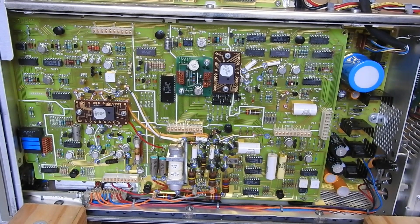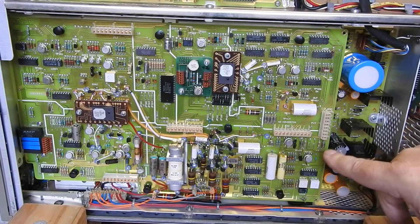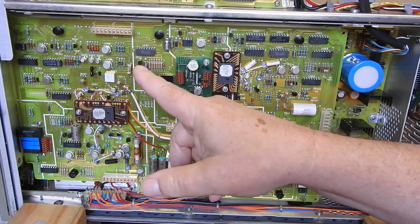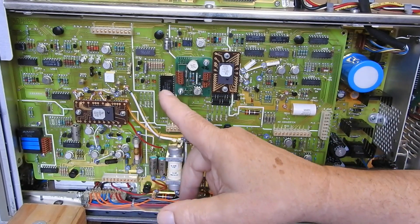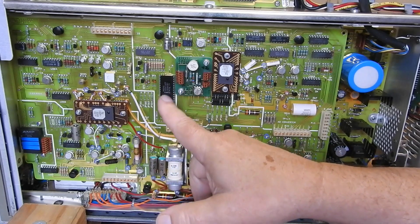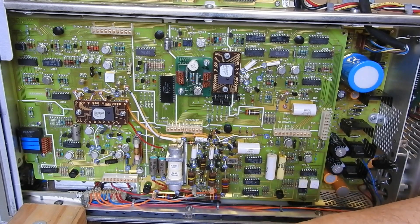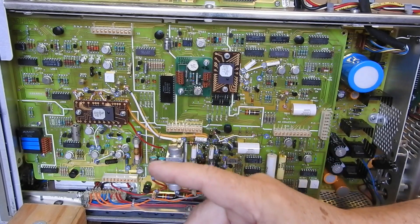Everything is so beautifully done — gold plating everywhere, lots of sections with air connections to Teflon inserts in the PCB for very high isolation resistance so the circuit board's resistance doesn't cause a problem. On the A20 board there are two more bits of unobtainium and the voltage reference using an LM399. There's also air wiring and Teflon inserts in the PCB; white lines indicate the sections. This is the input switching with the relays, then the input amplifier, the ADC, logic which controls the relays — this is the area we'll have to look at to work out what's going on with that noise. There's also the ohms current supply and calibration adjustments accessible from behind a plate on the front panel. I think I'll start looking at power supply voltages and the collectors of the transistors which drive the three relays, and see if there's any noise on them — that might explain the chattering. They're driven from an IO port expander, so we'll look at the outputs of that.